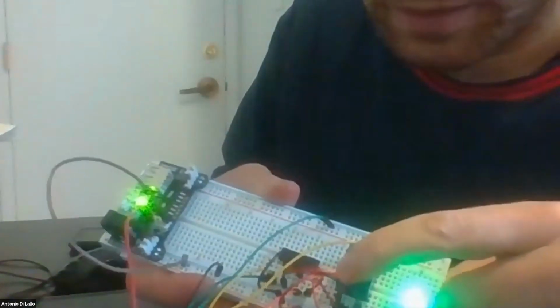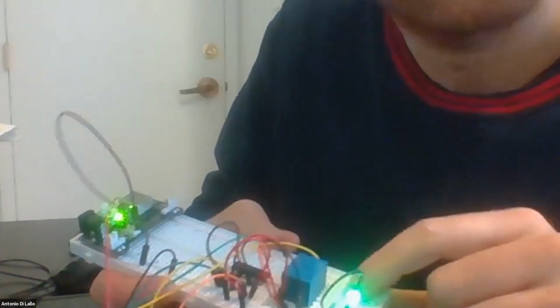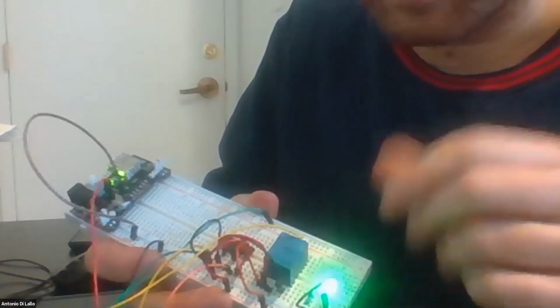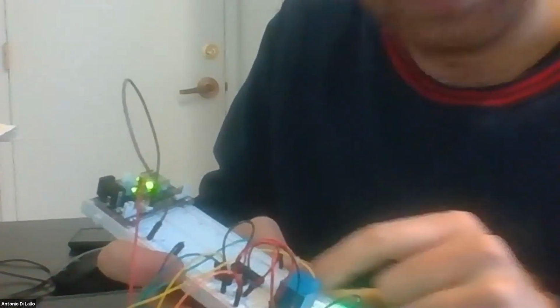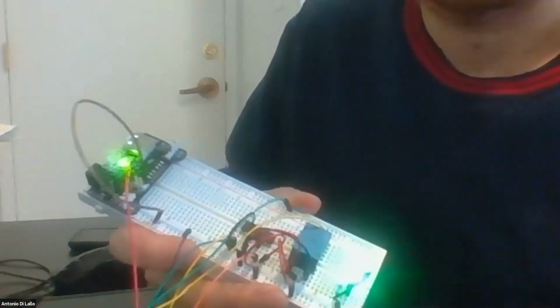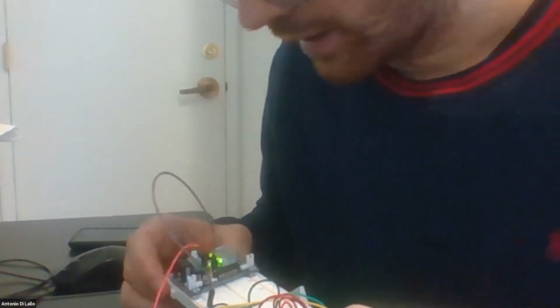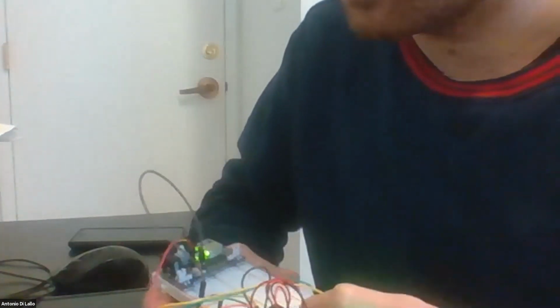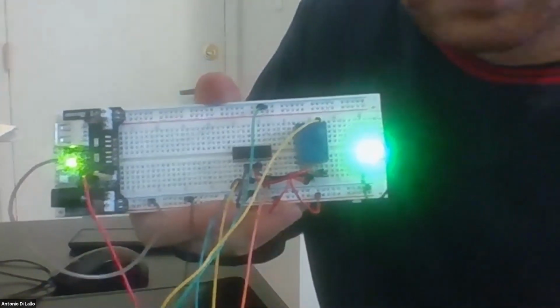Another practical aspect is that the pins of the relay are not very well aligned with the holes in the breadboard. So you need to maybe bend them a little bit to match the holes on the breadboard. And also push well, because otherwise it cannot have a good contact, because the pins are pretty short. I can show this, but I think it's more clear from the wiring diagram that I show you on the slide.